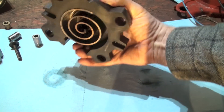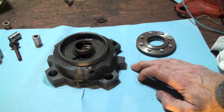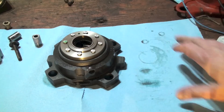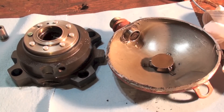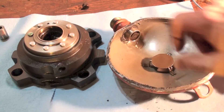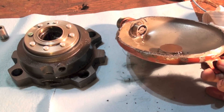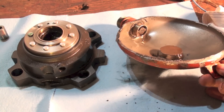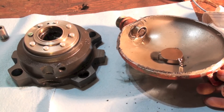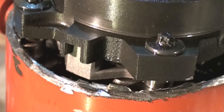This one does not have a discharge valve on this portion of it. Here we're showing the very top of the compressor — this is the discharge valve right here. This little spring-loaded valve does not allow the hot gas from the high side to come back in through the scrolls when the unit shuts down.